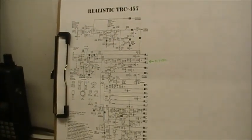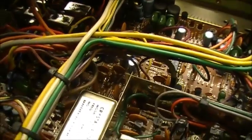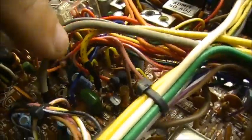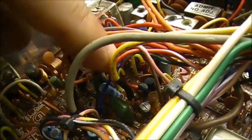So I'm just going through the circuitry here and I'm going to look at these two transistors. We're going to follow back into the circuit - this one here ends up down here by the relay and wiring, and this one ends up over here. We're going to check Zener diode D24, which is down there somewhere. Zener diode D24.